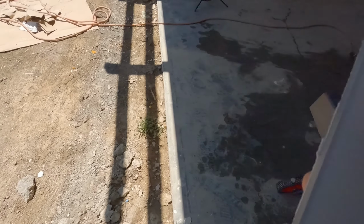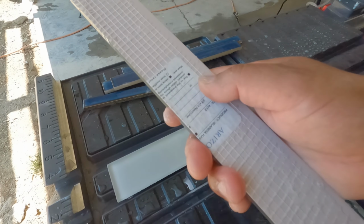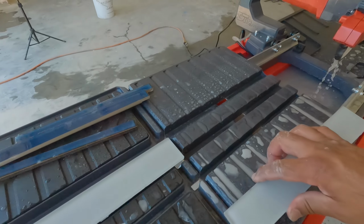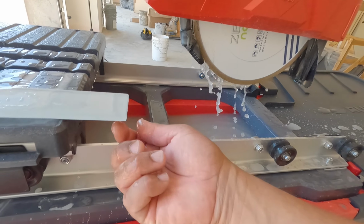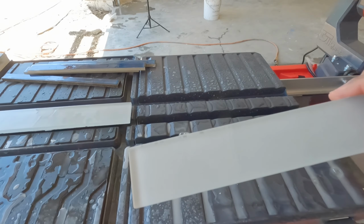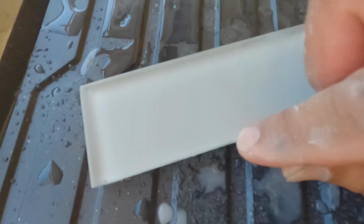Tiny. Of course, you do see that this is the reason you want to cut glass upside down, especially if you have a paper backing like this, because as you can see here, when the blade is pushing down like this and there's paper underneath, it's going to push the paper out, and that's kind of what you see happening here.